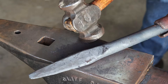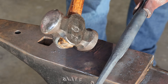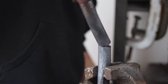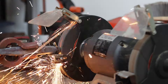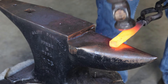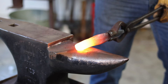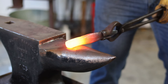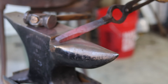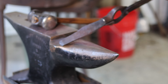The next step is going to be forging the handle. I'm going to cut off about a three inch chunk above the drift itself and draw that out to about the width of the thickest part of the drift. I should get plenty of length out of that with one inch round stock. I'm going to switch to using the horn of the anvil and the rounding hammer to draw out this handle. This will give me a lot more spreading in the lengthwise direction — the shape of the horn and the rounding face of the rounding hammer act as more of a fuller, or a pair of fullers in opposite directions, which helps draw out steel faster than on the flat base alone. That's drawn out pretty well. Next I'm going to bring it back to the flat of the anvil and hammer that into a rough octagon, and at that point we'll be ready to move on to the grinding phase.